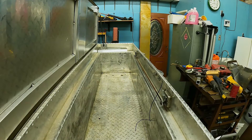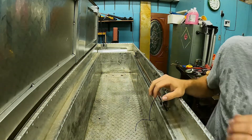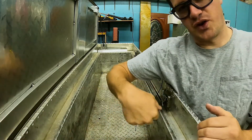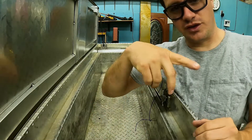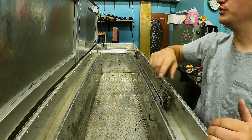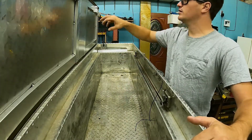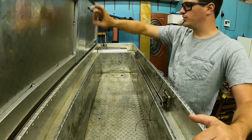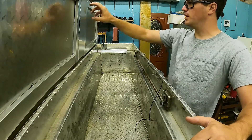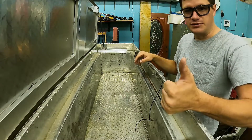I'm going to start off first and foremost — this is pretty thin, probably 18 gauge or so. I'm going to start out on all these cracks and just get used to it, get used to the new welding torch setup and how thin this is. And then once those are done, we'll strip this conglomeration off and reinforce this through top and bottom, and maybe even one across the middle. So stick with it.